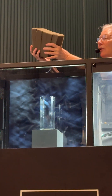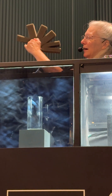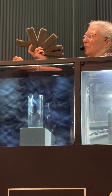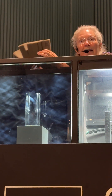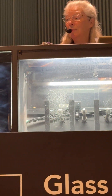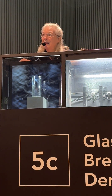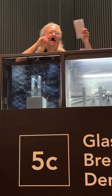And the same thing is true with glass. In a piece of glass, if there are stresses, they get paired up. If there's an area of compression, that's going to force another area into tension. So depending on how those stresses get arranged in a particular piece of glass, they can make it more likely to break — like the bottle did — but there are also cases where those exact same stresses are used on purpose to make glass that's less likely to break.